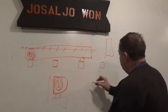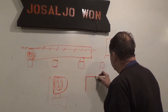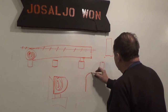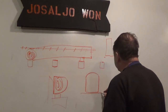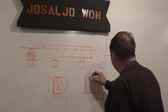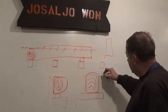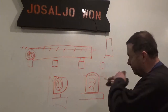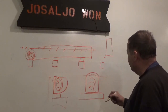But if you don't put the bark down, once you make 2 cuts, if you put the bark up and you put the cut down, in other words, there's your bunk rail, something like this would probably look like. Now when you make this cut it will be parallel to that cut, and you'll have a square cant or rectangular cant depending upon how you made your other cut, okay?